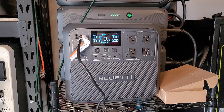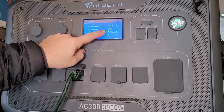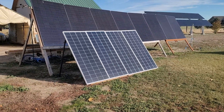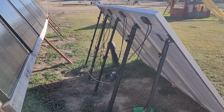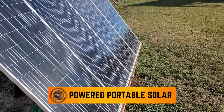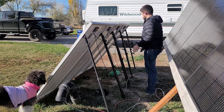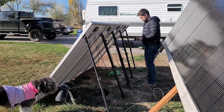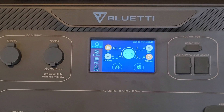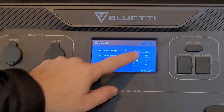I plug it right here into the front of the system and I'm going to steal the solar panels that have been running my AC300. We can see we're over the 60-volt limit at 62.3 volts and we're getting 650 watts, so I'm going to have to adjust these solar panels and how they're connected. I'll use these 210-watt panels with my patent-pending solar panel legs — available at poweredportablesolar.com — connecting the first two together in one group and the second two in another, using a branch connector so I have one positive and one negative connector. Once I run that back, we're down to about 400 watts but our voltage has dropped to within the safe range for the Elite 200 V2.